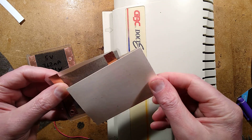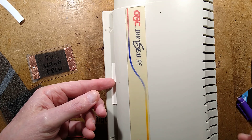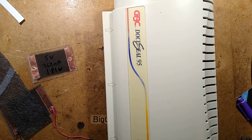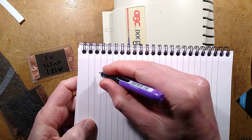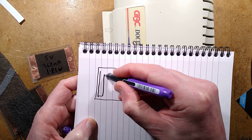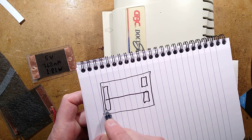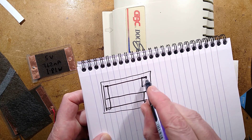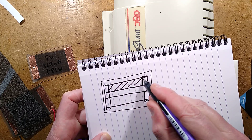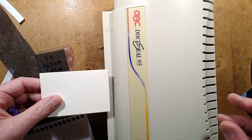I shall put this in like this and feed it through. At this point while it's feeding through I could bring in the notepad and show you other options. If you wanted to more than double the resistance, you could put a bit of copper tape like that and then two bits of copper tape like this, and lay a section of the carbon fiber across — you'd end up with two thinner sections which should make it much more suited to higher voltage.